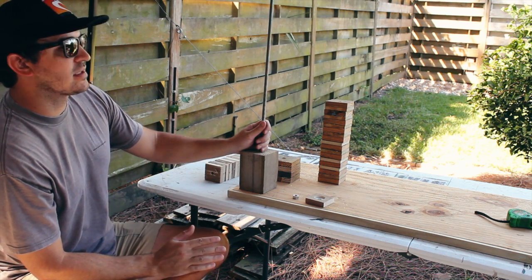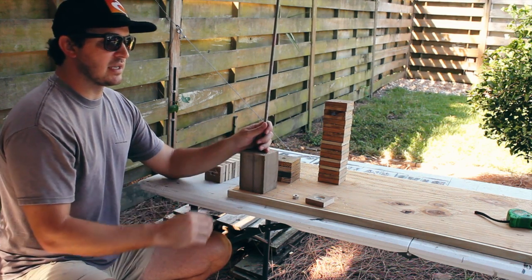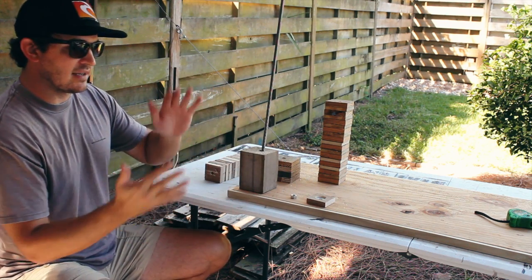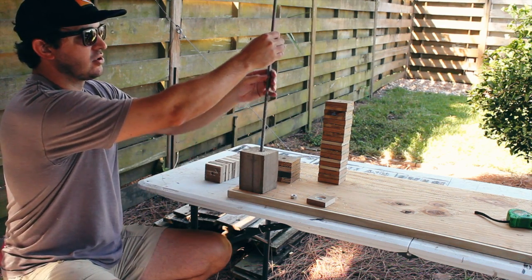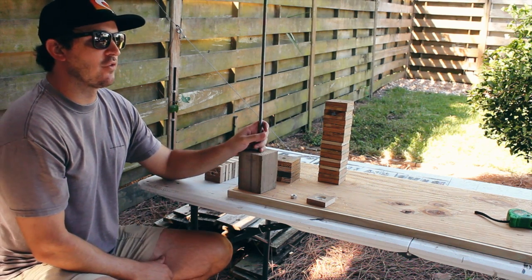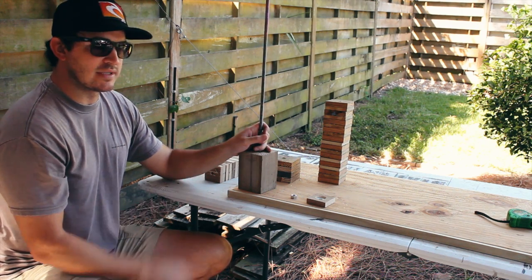And then once everything looks nice and square and looks like it's going to be okay, I'll disassemble them and then put glue in between each layer, stacking them all the way up, with the nuts on both ends, and I can clamp them down nice and tight. That should allow the glue to set nice, and then it'll have this nice center steel little rod going through there for support. And so that's the overall idea for the leg. So I got 2 built right now. I need 2 more for the back, and then I'll do all those steps I just mentioned.